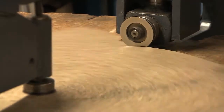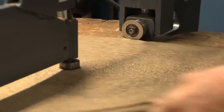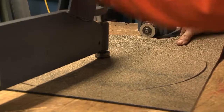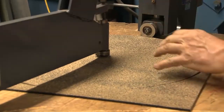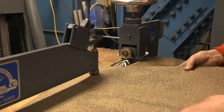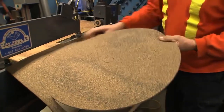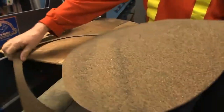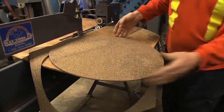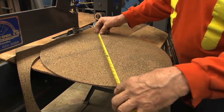Starting to cut through now. And there's our gasket. I can just take this out of here now, raise the blade up, pull this out — there's your outer diameter right now of the gasket you're going to be making, and you can see it's exactly just shy of 20 and a half inches.